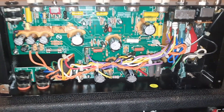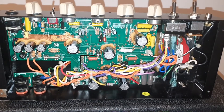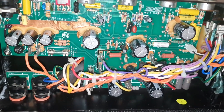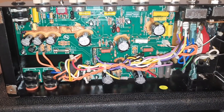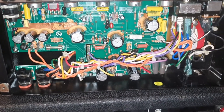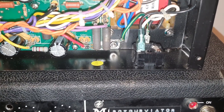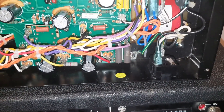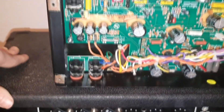Let's look at the guts. I won't spend too much time inside because we'll have plenty of chances in the next videos. The caps are stabilized with some kind of goop, which is a good thing. Components are also looking good — you have 400-volt caps and 630-volt caps. I found that two of these resistors are looking sketchy; one of them is cracked — it's R3. I'll look into the schematics later to see what it is. Nothing else suspicious here.